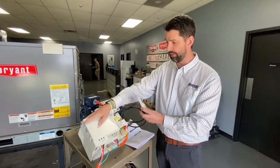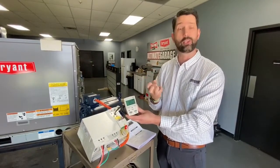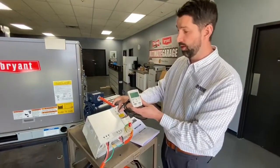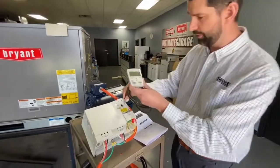The reason that these drives aren't shipped with the keypad is that this keypad actually has the ability to retain a little bit of moisture. Obviously moisture and electronics don't mix, so when you're done with the keypad, it's important to unplug it and take it with you and not leave it with the drive.